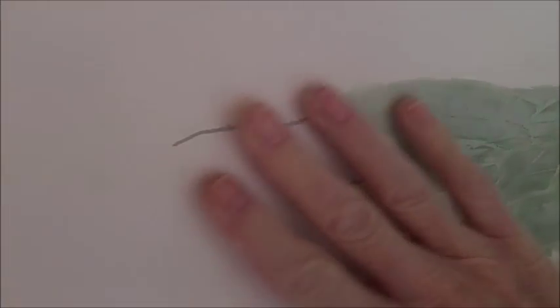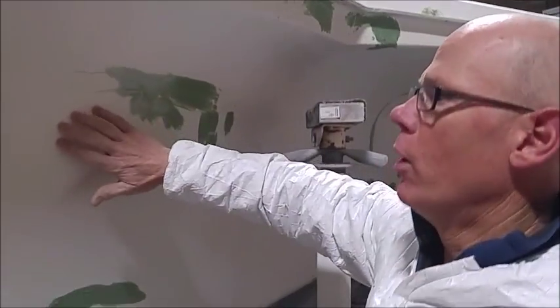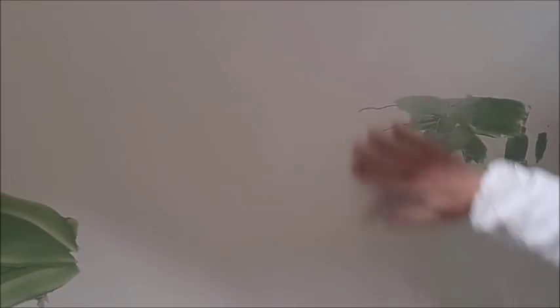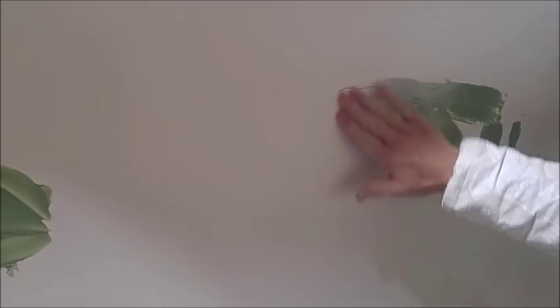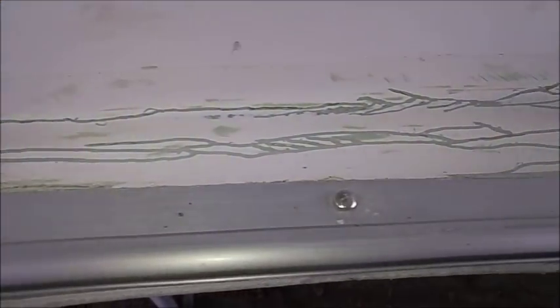We're removing the filling material with 120 grit sandpaper, which is the final grit prior to painting that all grip paint calls for. As we sand off the fairing material it leaves simply the filled cracks, which will be ready to paint after sanding and cleaning. We'll make sure it's filled properly with no dips or swales. We'll be right back.